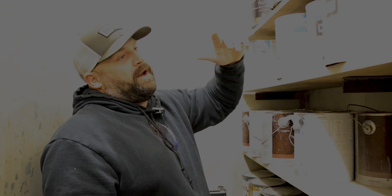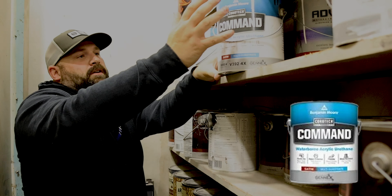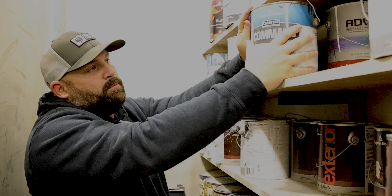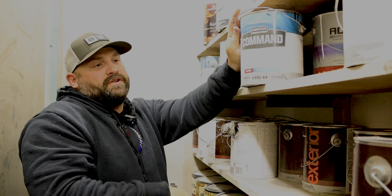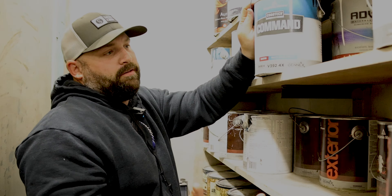If you're looking at painting a door or something, there's a great product by Ben Moore called Command. It is a waterborne acrylic urethane — it acts like a urethane and does the same thing as the old urethanes did. It sticks to almost anything — I haven't found anything it hasn't stuck to. It's a waterborne product, so you can clean up with soap and water and you won't have those nasty chemicals. VOC-wise, it's a lot lower than typical urethane products.